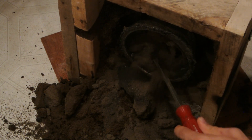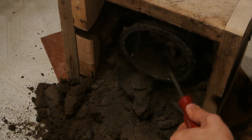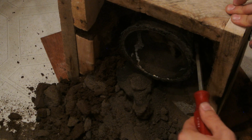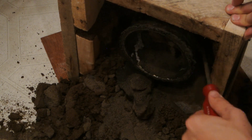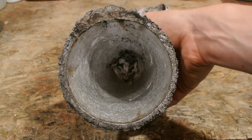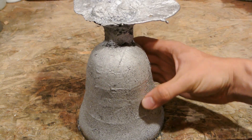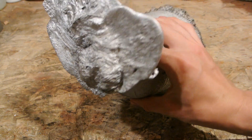After things cooled down I very cautiously opened the mold, not sure what I would find. To my extreme shock, it looked like the casting had actually worked, at least in some regards. The very base of the bell — the rim — was intact and that gave me a lot of hope. As I continued to remove the sand, I was shockingly left with a bell shape. The bell looked like it had worked pretty well, and I could not see any bubbles. It was still pretty rough, which I think is a product of the grain of casting sand I'm using — I should use finer sand.